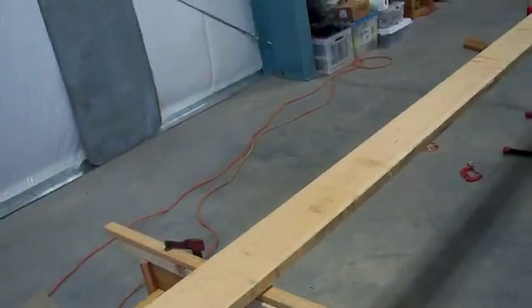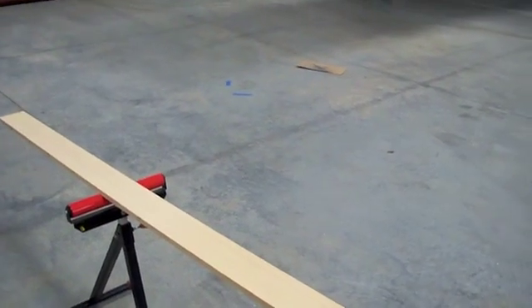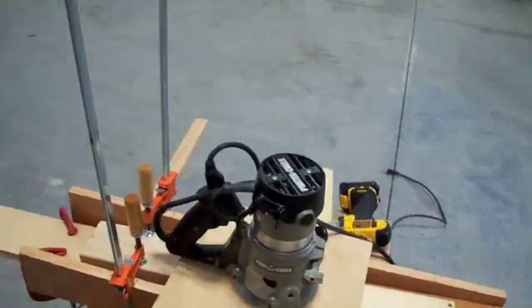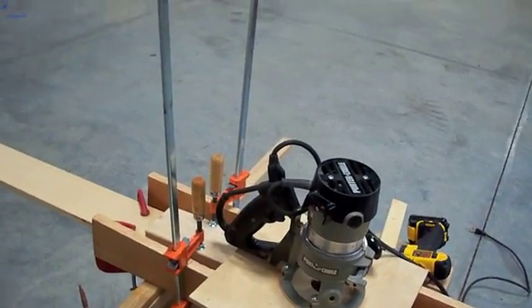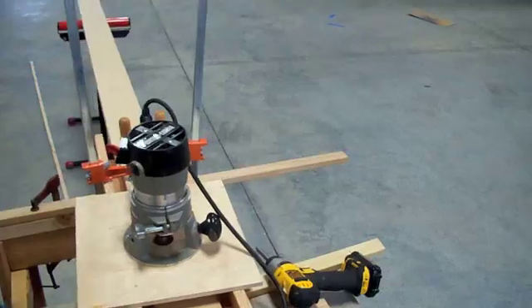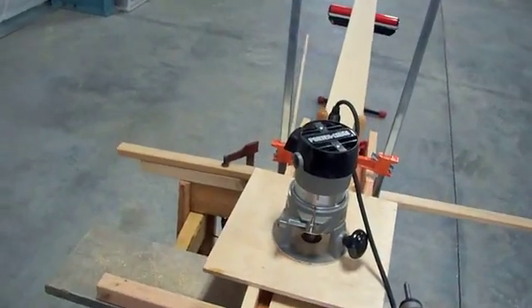Should be ready to go — it's a nice piece of Sitka spruce. I've made my rear spar here, took a big piece of spruce, made it into a smaller one, cut it to the width, height, and length. Now I'm going to do my 15 to 1 spar splice onto this one, making sure that I'm splicing from the right side because there is a small pitch on this spar for the ribs. Looks pretty good.